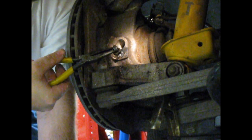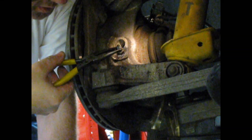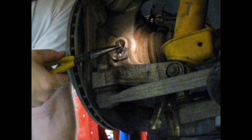All the way out. Broken bolt welded to a nut. The threads look pretty good in the hole there. I'll probably just run a tap in to make sure it's cleaned up, and I'm going to make sure to use anti-seize on the new bolt that I put in.